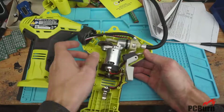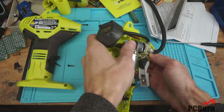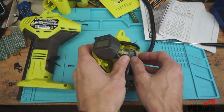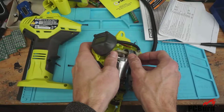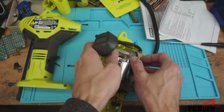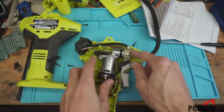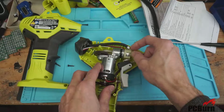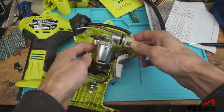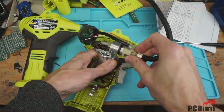This looks largely the same as the other air pump. It's just a single piston in there. Oh, this time we're using, it looks like white lithium grease. So now they're using the same grease that I used to clean up the last one. Interesting. And other than that, this is largely the same assembly. It's just got the ball for the check. Let's see here if I can get it off without too much fiddling.